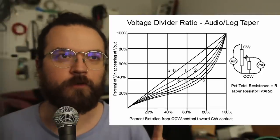I think I could go further. I don't remember if that 1/5 rule was specific to guitars or tone suck or something, but anyway, yes, you can modify the taper of a potentiometer. Yes, the taper of a potentiometer is important for control purposes. Even now, after adding the resistor, it's kind of hard to get that to rest at a really low pitch modulation. That might be kind of close to what it was like from the factory, but I think next time I open it up, I'm just going to try a higher value resistor and see if that makes it any better for me.